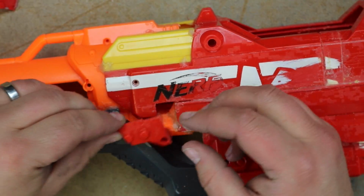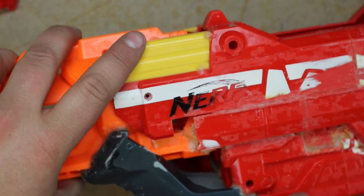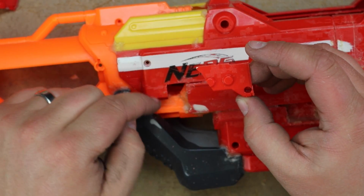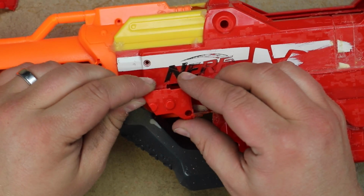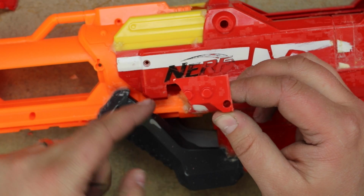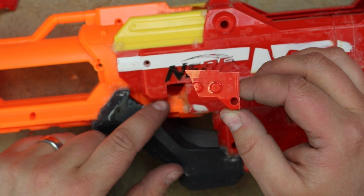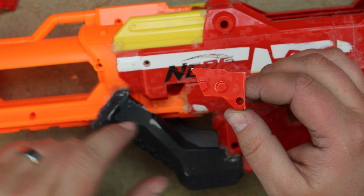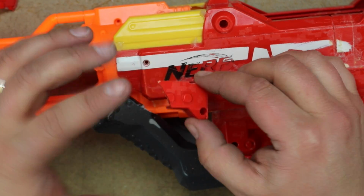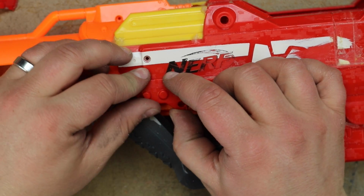Now, since we have this amount of overlap, that was close. We could cut this area out, but I think what I'm going to do is just cut this piece down and over, and we'll have this piece come up and lap over, which will give us a nice little lap joint, which are always nice, even though it's not really a stress point, especially since we'll have so much more going on here. But I think it'll be easier to shape and just easier to manage overall. So that's what I'm aiming for there.